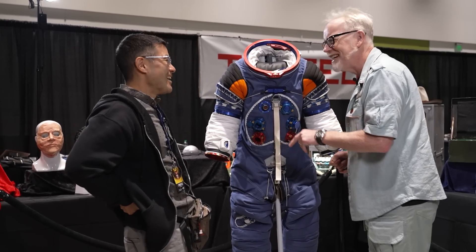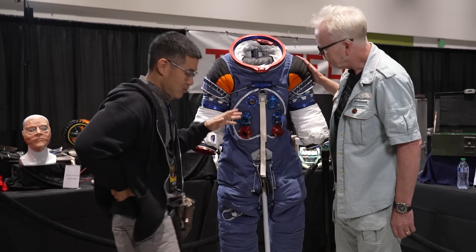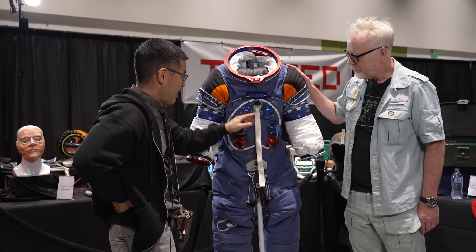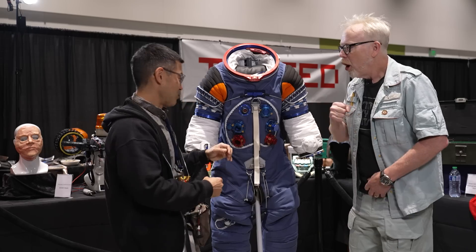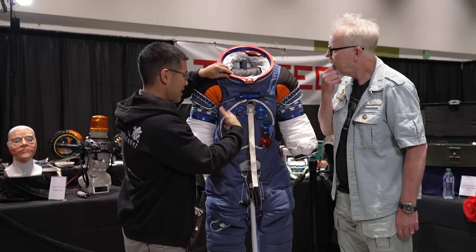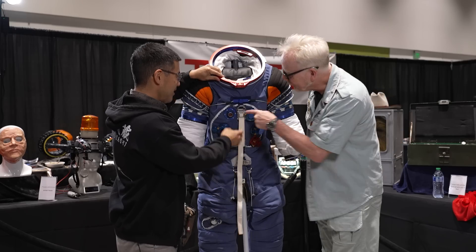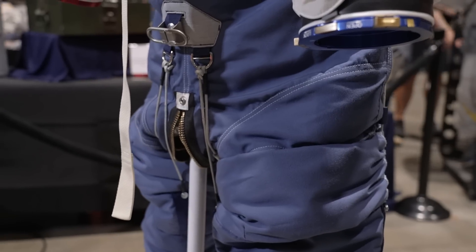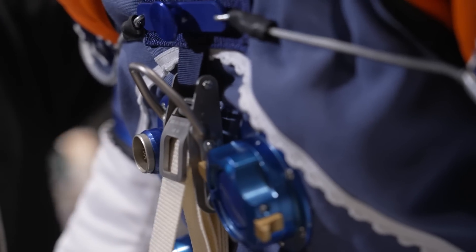There's one other thing — because you mentioned the joints, this suit did have to bend when they sat down, and it's the original suit not the B-suit. In order to do that there's a block and tackle so you can get enough force to actually force the suit into a seated position while it's pressurized. It never worked in any of my previous replicas, but when I copied it exactly it actually does start to do that. This buckle is laser cut — though I've figured out I can 3D print them now; when I first started it was too expensive, but the prices have gone down.